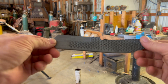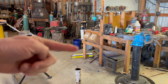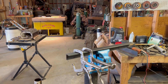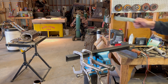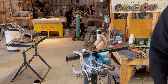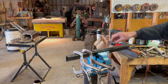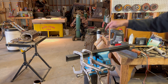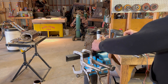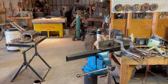Got a little bit of scale on there, not too bad. Over here we've got our forge, our oil. I'll take you over and show you this — what I'm gonna call a straightening jig. When we get the knife out of that forge and dunk it in the oil, there's always a chance it's gonna pick up a warp. So I've got this piece of straight angle iron — we're gonna take it right out of the oil, put it on here, put this one on top.